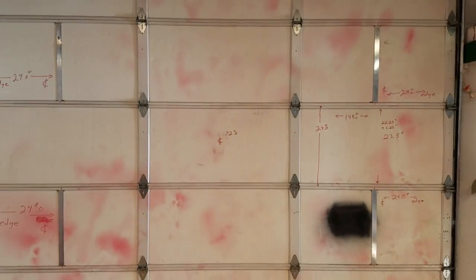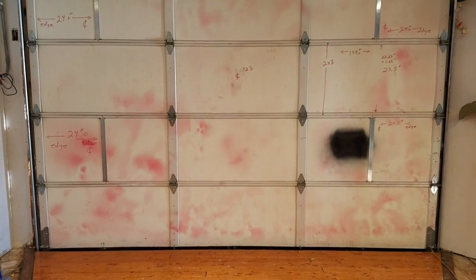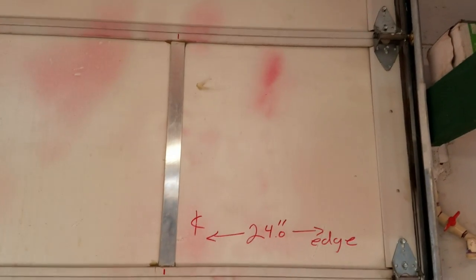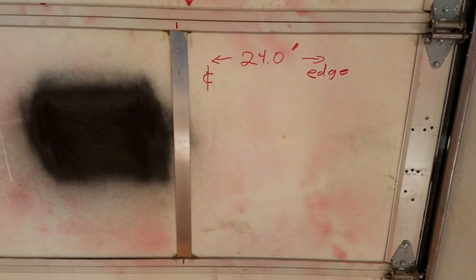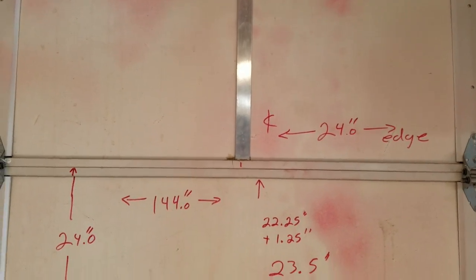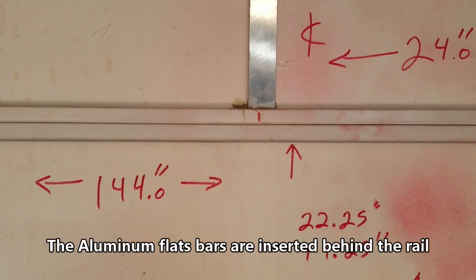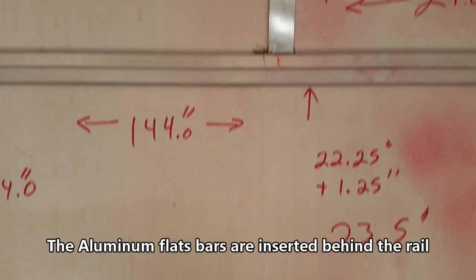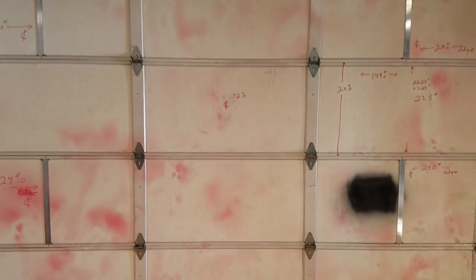Here's what we've got done: I have the vertical strapping designed to mount a marker board or chalkboard to the door. They're two feet long and exactly spaced — datum lines established at exactly 24 inches on center. They're quarter-inch aluminum strap, inch and a half wide, held in place right now with construction adhesive to stabilize them. Once the foam boards are installed and the foam is injected, they'll be well established and more than adequate to carry the load.